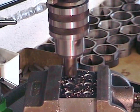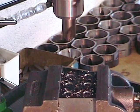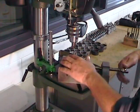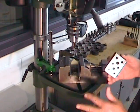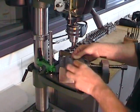But before we move on to our 11 millimeter holes and change our chamfer depth, we're going to flip the part over and do the six chamfers on the other primary surface. This will save us a couple of setups, and in reality, it'll speed up our work. Remember, when you flip the block over, keep everything really clean.